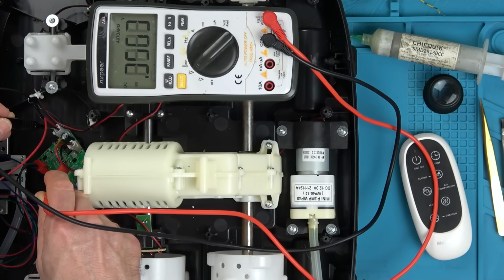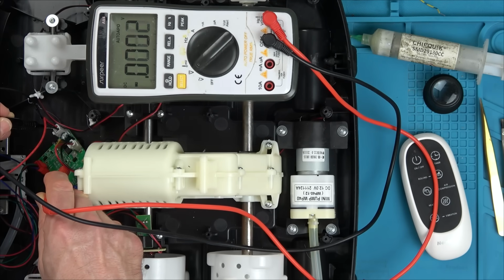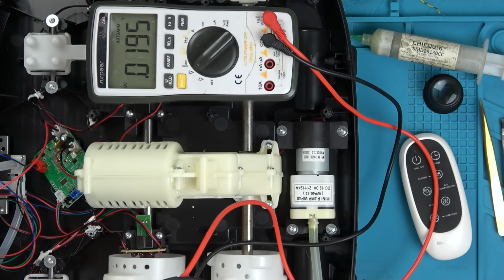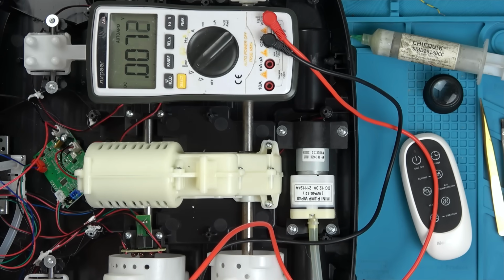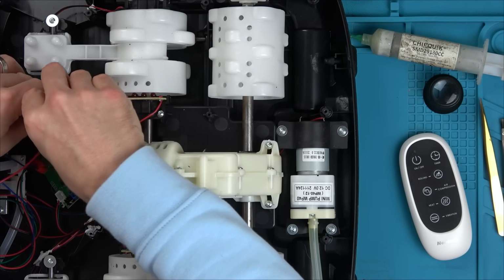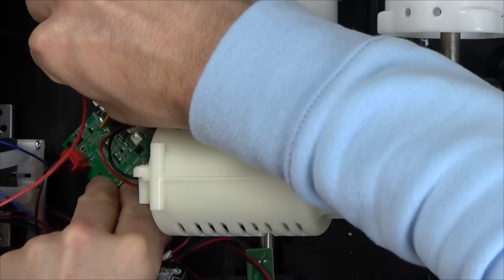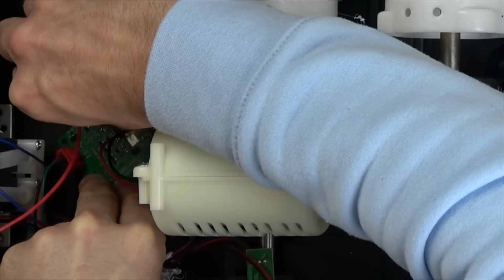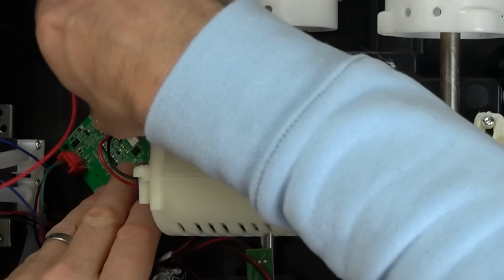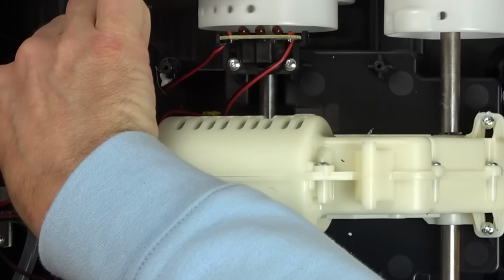Yeah, we've got 12 volts at the gate now. Okay. Yeah, okay. So that's the reason we're not gonna get anything, because I haven't got the positive. Oh, that's a shame. So if I was to go from the positive here, then we'll see it suddenly come alive. Positive in here. Because the microcontroller's turned it on, but we haven't got a path now through. So if I go between there and here, I think it's going to work. There you go. There you go.